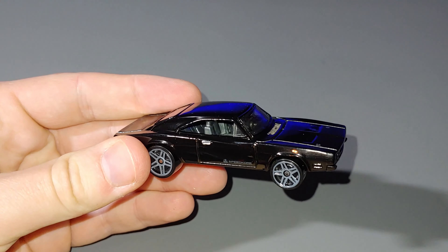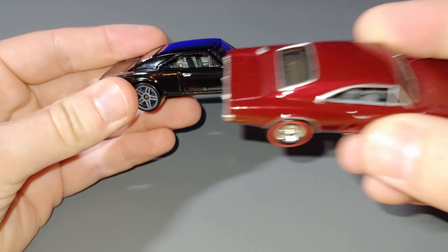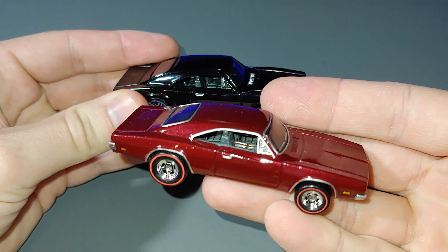As you can see I've already taken the time to drill the base out on this one. I start off with a 2mm drill bit and then work up to a 5mm to remove the main pin piece. I like to use some 5mm self tapping screws to screw the base back on.